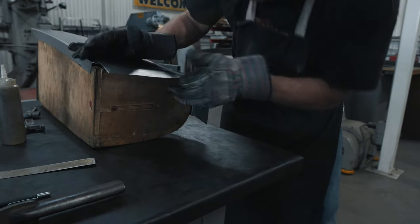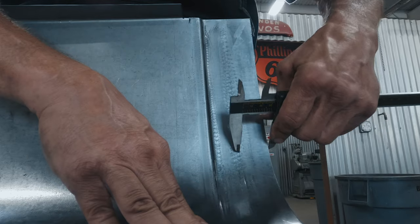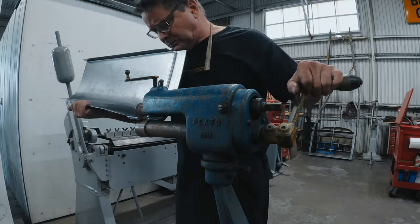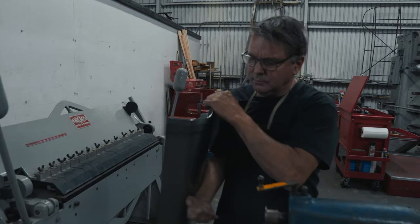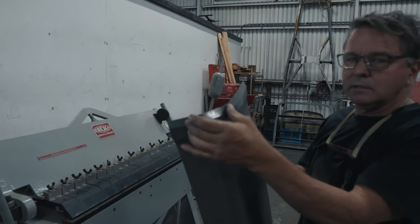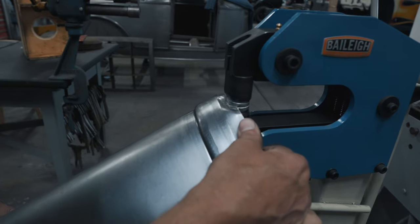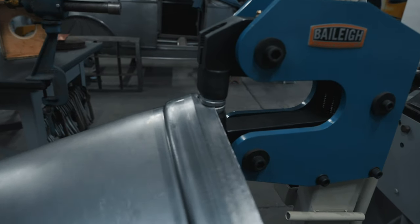It fits nice right there — it fits our buck. Now I'm going to scribe on the inside and then we're going to tip this flange under. So now I'm starting to get wrinkled here, need that to go over. That means I've got to shrink this area right here. So I'm going to go to my favorite kick shrinker of all time. If you haven't got one of these yet, you need to order it — it is the baddest little kick shrinker on earth.